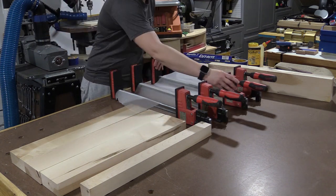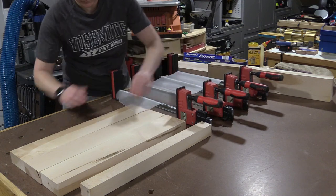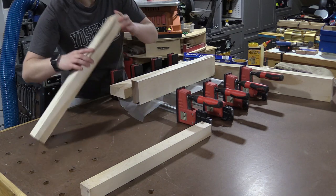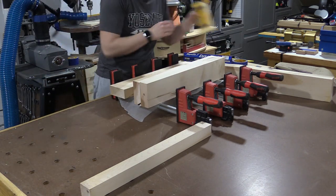So I'm going to glue up three of the big boards and leave one extra board off. I'll plane that down to the exact same thickness as the three boards together, and then do that glue-up closer to the end so that I'm able to get at least the bulk of this through the planer.